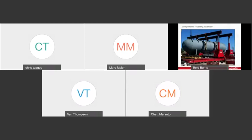Next, we've got the pump unit. So this is the heart of the gantry unit. This is what supplies the hydraulic fluid at pressure that's actually used to lift the load. And these pumps are either diesel powered, propane, you can find them electric, all sorts of different modes of powering them to meet the needs of the site that you're working at.